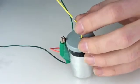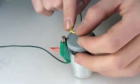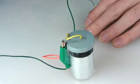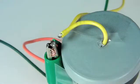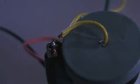Now, that little spark did demonstrate that a charge was held inside our capacitor, but I knew this setup could do better. I exposed a section of the center conductor and brought it close to our connection to ground. I taped them in place. Once the charge is strong enough, electrons should jump across this spark gap. And jump they do. Our little Leyden jar keeps working over and over and over.